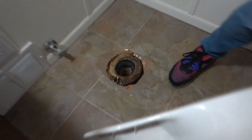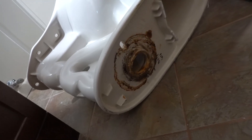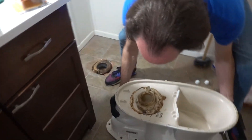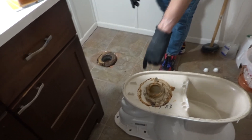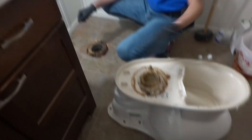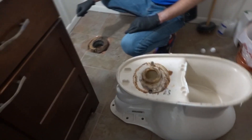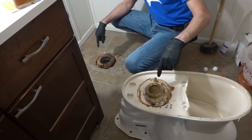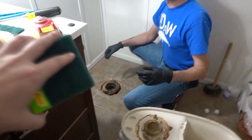There should have been a lot of wax. This is where the wax ring goes. Jesus, if it were solid, you wouldn't be able to make it solid — it would crack in manufacture. We've got to clean this off, we've got to clean that off, and that's the job. You want to lightly clean all that off, but not enough that you really scuff into the porcelain. This is going to be nasty. There might be all the paper towels left in the house.